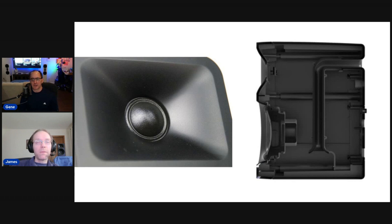This speaker measures very well. It's relatively neutral — it holds to pretty much a plus or minus 2 dB window from 200 Hz to 20 kHz. That's really good, and this is one of the advantages of active DSP crossover. You don't need passive parts to smooth out the response, and there's no room for passive parts in a speaker this small anyway. It does it all through digital equalization, and it gives you a really, really good response. This is a neutral speaker — it sounds very tonally balanced.